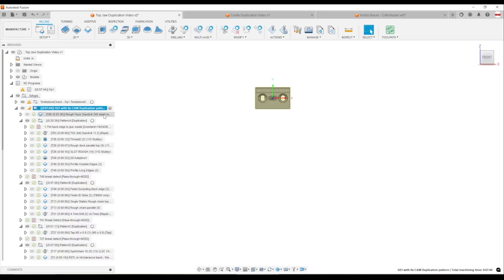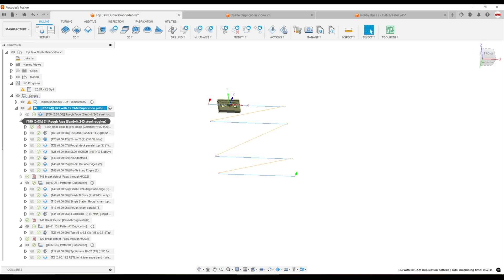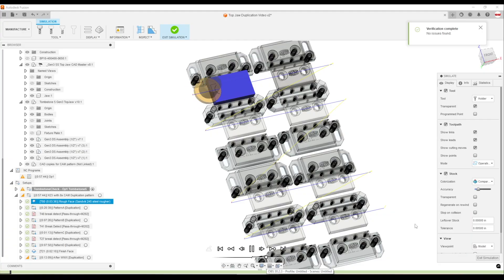If we need to update the position of one of these parts by 10 thou, I know exactly where to do it in one sketch, with full confidence that it's going to flow through to the CAM. When we come back into the CAM workspace, the way this pattern is handled — we hop in and out of the pattern. The first thing is not a pattern; it's a single roughing operation where I programmed it with sketch traces to rough all eight of them with a single flow.